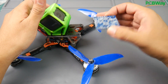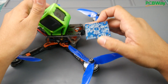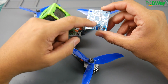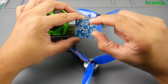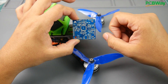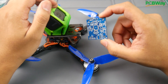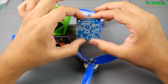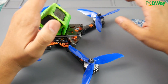Tuning it is absolutely easy — I just didn't have a PC on me. The overall performance had no hiccups. The oscillations we were having are 100% not due to noise touching the gyro. That's why I used the LDO linear voltage regulator — it decreases the amount of noise that could seep through like a switching regulator would. I chose a pretty massive one, not like the tiny ones on typical flight controllers you buy online, and this proved to me it's performing very phenomenally.